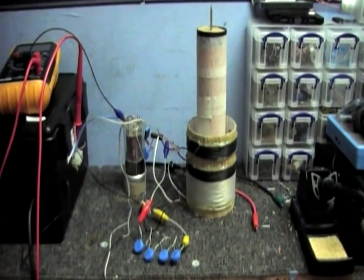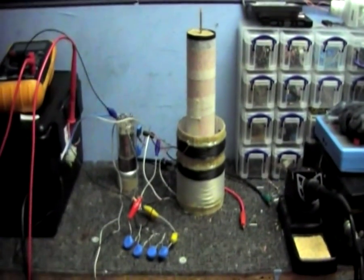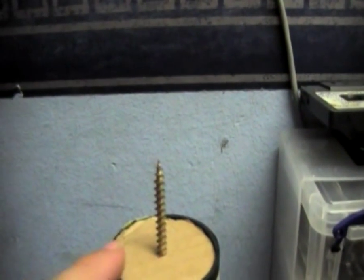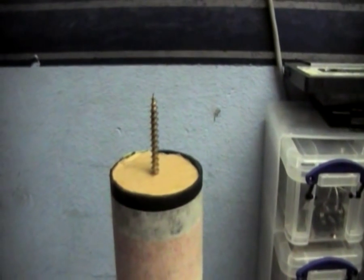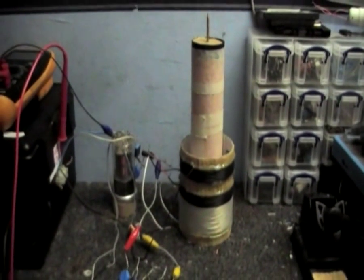What I'm going to do today is make another Tesla Coil, but I'm going to do it the CoolDudeKlem way. I've got a primary here — this is the one I used in my solid-state Tesla Coil, which I've just modified. All I've done is removed the top load and just left the breakout point, because these things seem to work better without a top load when doing vacuum tube Tesla Coils.